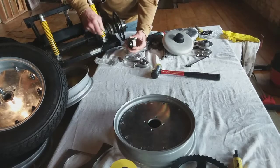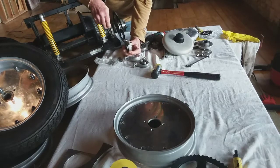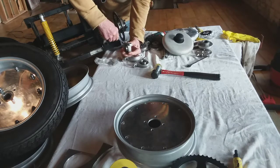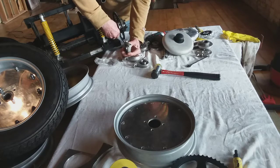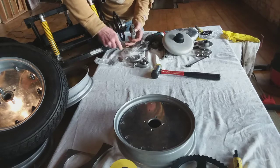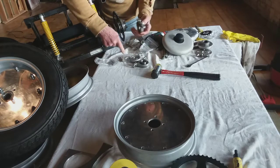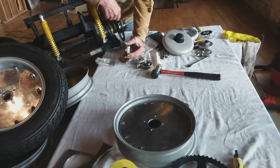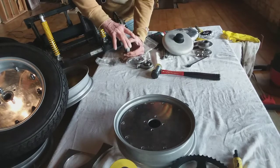So what I've got to do on here, if I want to keep it parallel, I'm going to have to weld up and build this up. I'll probably sleeve that, put a bit more square section on there that length, then step up so I can get the centre of that parallel with that.